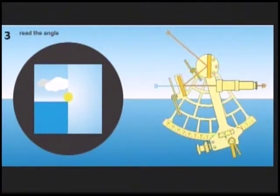So then the question is, why does the sextant only have 60 degrees? Could you ever want to measure something higher than 60? And the answer is yes. You could have the sun straight overhead, especially if you were a navigator at the equator. But it turns out that if you've got a straight-through telescope, it is very, very difficult to look higher than about 70 degrees up. So 60 degrees turns out to be a reasonable compromise for the navigator. The astronomer may want to look at angles that are straight up, and the astronomer's telescope usually is the better tool for that.